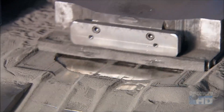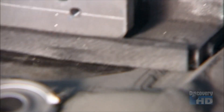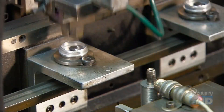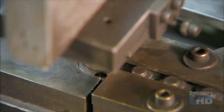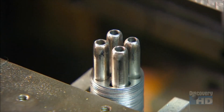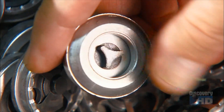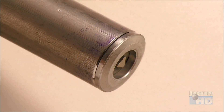Many components are made of powdered metal — mostly iron powder mixed with some graphite and copper. After a press compacts the powder in a die, a furnace fuses the particles. This powdered metal part is the valve through which the piston forces the oil. Steel discs and a spring help control the speed with which the valve operates for varying driving conditions. A stamping tool crimps the end of the tube, holding the spring in position. The valve, now fully assembled, seals the bottom of the pressure tube.